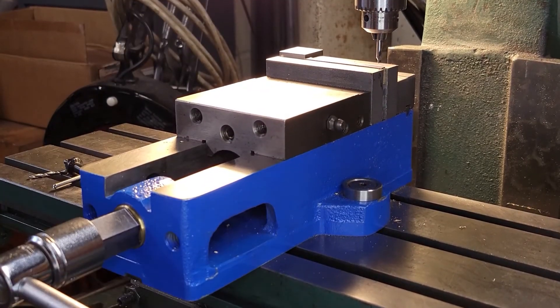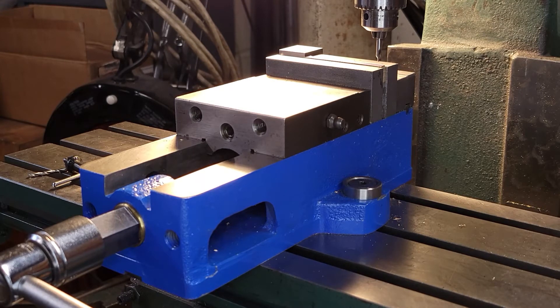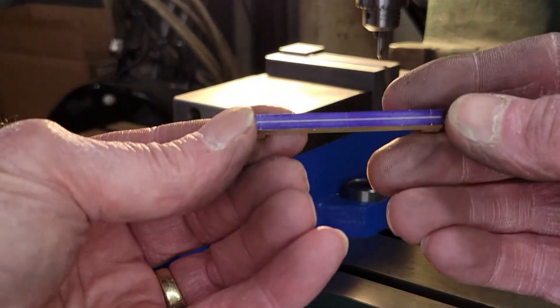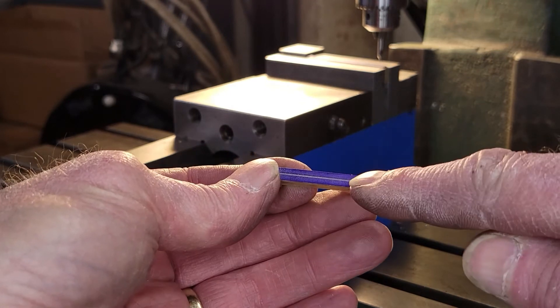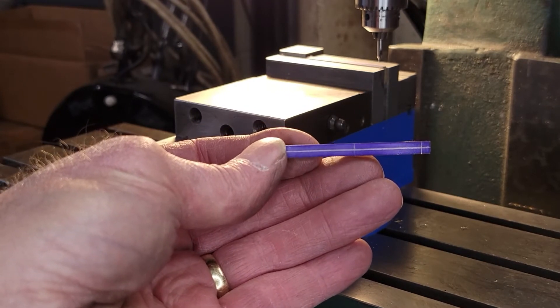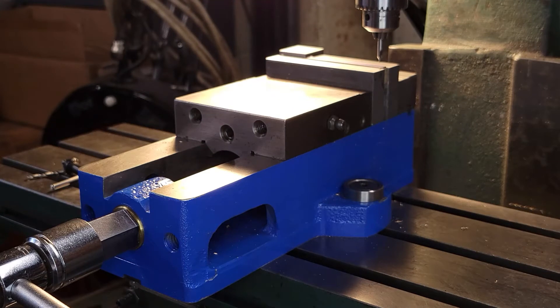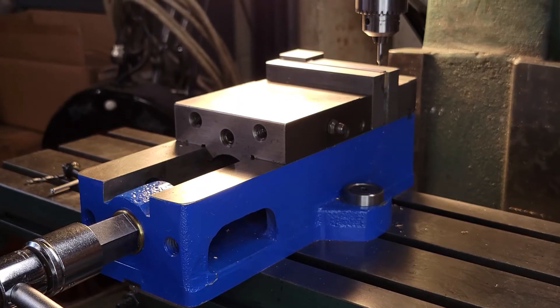I've changed the setup a little bit. I put a drill chuck in a collet in the mill, and I put a stop on the vise so I'm indicating the same spot each time. I put an edge finder in and indicated the edges, so I am exactly on center now and I'm one-eighth of an inch in. What I'm planning on doing is drilling four holes on each one, then I'll move it over and drill the center hole. I'll use my dials to actually dial it in. This milling machine does not have a quill, which means I've got to do all of the drilling by raising the knee.